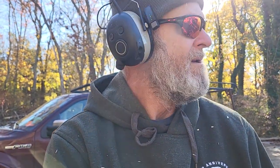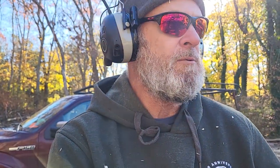So if you're looking to win races, then go in there with the 5/32, undercut the tooth, create an edge that's going to get wiped out in 2 seconds, but it'll cut fast. I want my chains to last, so when I pick up a saw, it cuts. There's nothing worse than watching somebody with a dull saw try to cut something. It drives me crazy, and I cannot stand it.